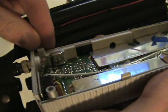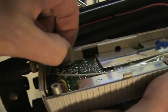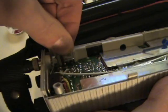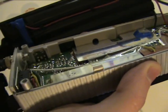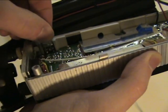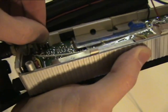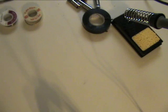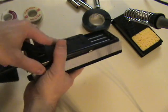As you can see in our TRC-207, it is plugged into a socket right next to the transmit button. So all you need to do is pull this one out, and plug your new crystal in. The polarity does not make a difference on this, so it doesn't matter which way you plug it in. After that's done, reassemble your CB radio and you're ready to start having fun.